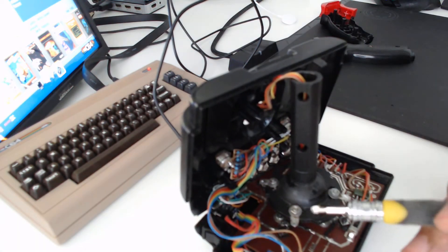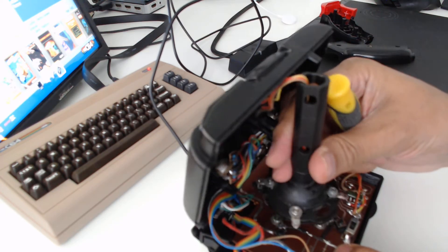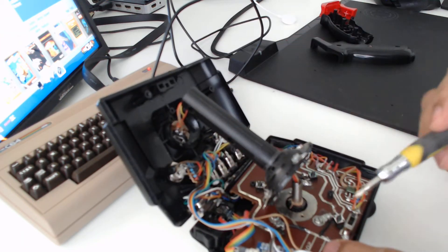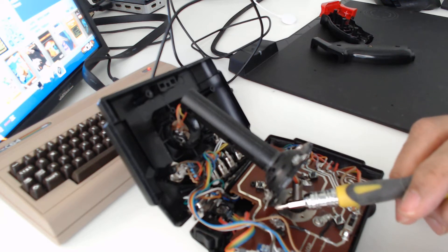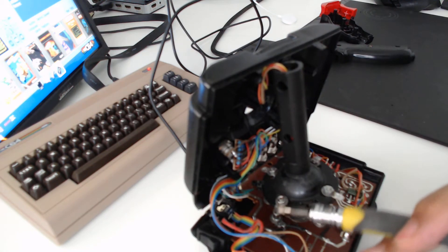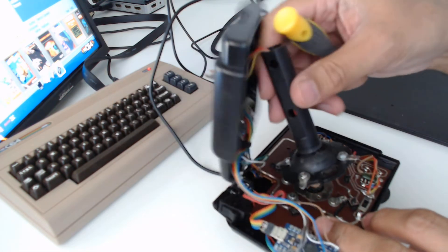As you can see, the immediate difference you might notice if you open up your own joystick is the addition of the position of these strikers here. This design is kind of copied off QuickShot's own because the later joysticks have some plastic protrusions to press on micro switches. Now if we were to position switches underneath the original position without these extra bits, they will break off because there will be too much pressure directly on top of the switches. So these extra pieces here do allow for a little bit of flexibility.